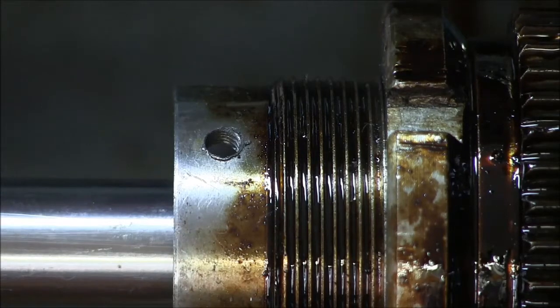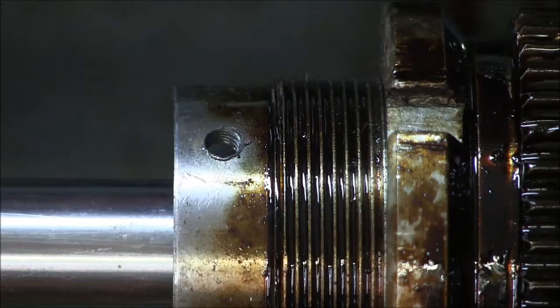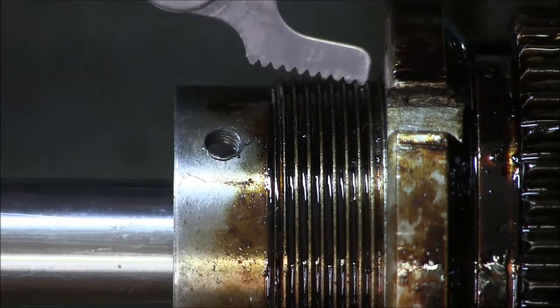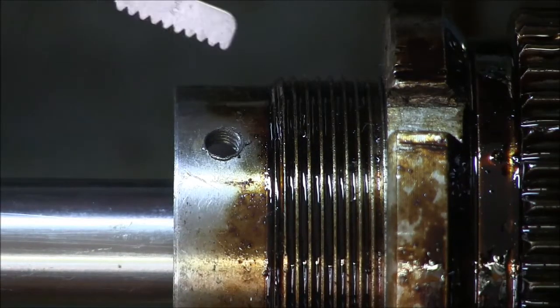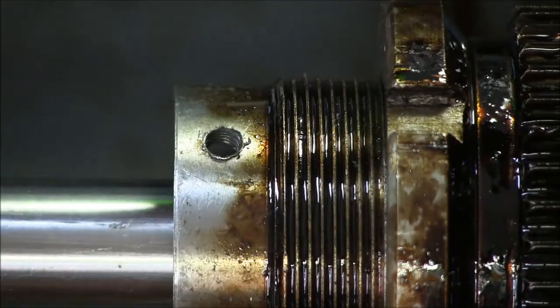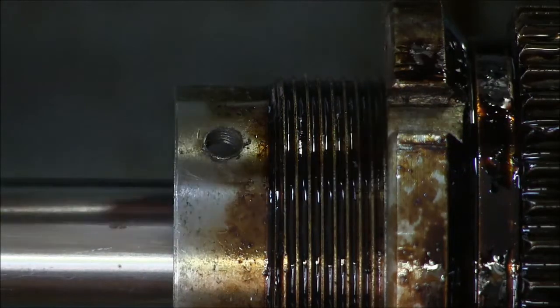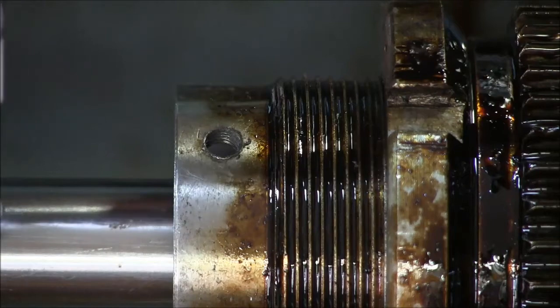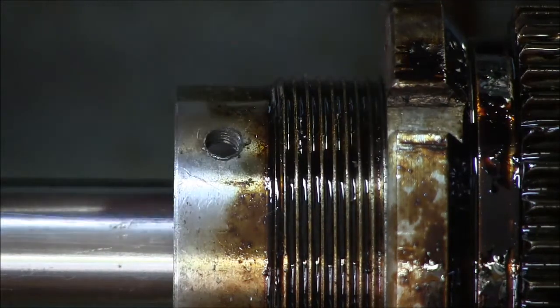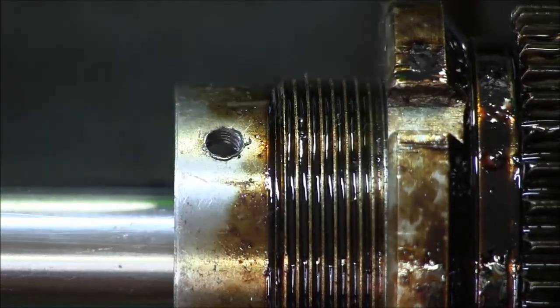And then what we're going to do is we're going to take it off. I got a piece of 4140. I think it's 2.5 inches, which is a little big for this. I would have preferred 2-inch, but that's all I have. And we'll bore it. We'll thread it inside with metric, which is going to involve changing some of these gears, so we'll show you that. And then we'll put it on the rotary table and drill 3 holes 120 degrees apart and thread them, and she'll be done. So yep, here we go.